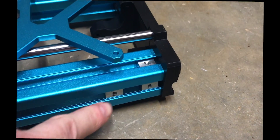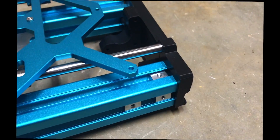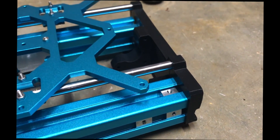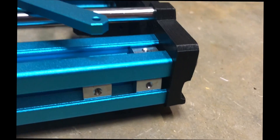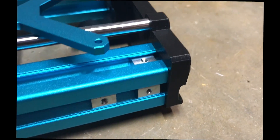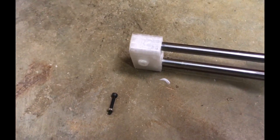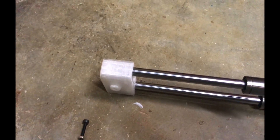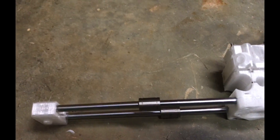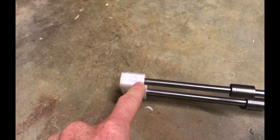So on the Prusa Mini kit I would use the short nuts with the appropriate length. The ones that came originally weren't the correct size, but these match the extrusion almost spot on. I think they may be a little bit shorter than the stock Prusa ones, but they are M3 screw size. Since Prusa redid the website, I think they've removed the troubleshooting part of the Prusa Mini instructions, so there's not really a lot to go on. But I believe it was an M3x18 with a hex nut for the Y-axis belt screw. So we'll try this first and see if it fits — and it does fit.